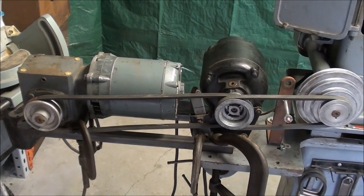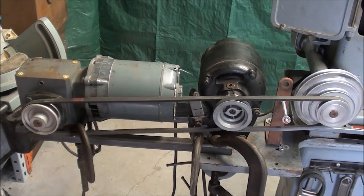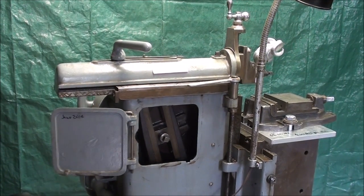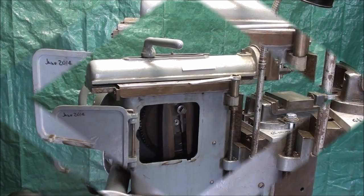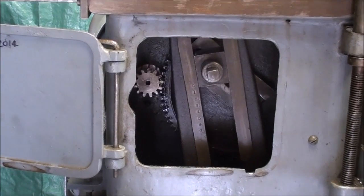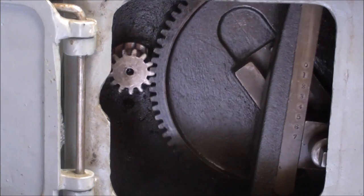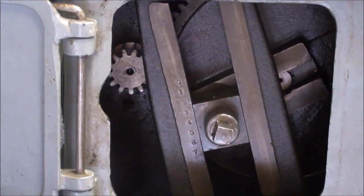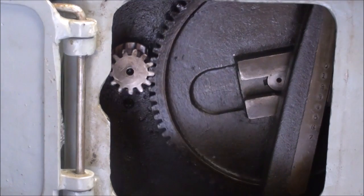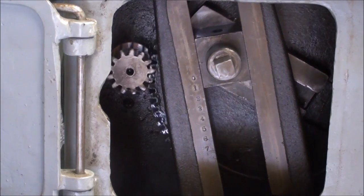Take a look at how slowly this thing runs when I turn it on now. That's the drive system, and there's the ram moving ever so slowly. With my temporary drive system, the shaper is running at about four strokes per minute. Looking in the works here, you can see the big bull gear and the spur gear, which is the drive gear, and the scotch yoke. And then of course it all comprises the Whitworth quick return mechanism discussed in the earlier videos. This might give you a little idea of what's happening, but that's why I went to all the effort of building that teaching aid in the previous videos.